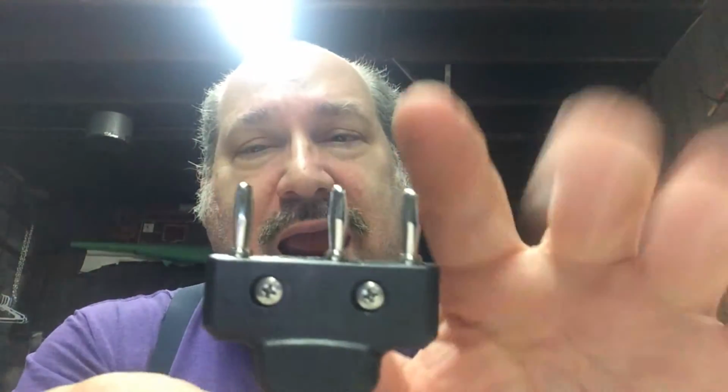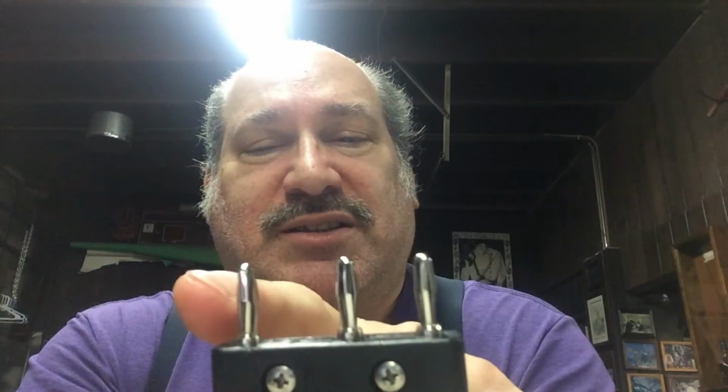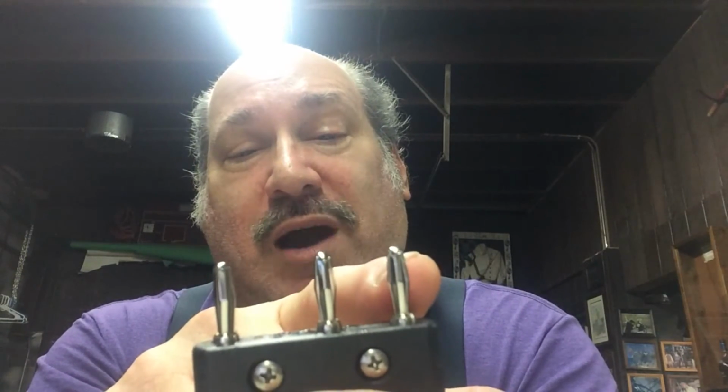In the 3-pin end, again, they're A, B, and C. B being the middle, A the closest to it, C the farthest away. The only reason I have that distance is to make it idiot-proof. The pin goes in the socket one way. Again, this is the body cord clip in saber and foil. That's the wire in foil. Other wire in épée. That's always the ground line. Those are the German style.